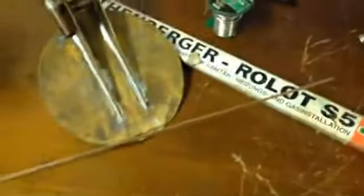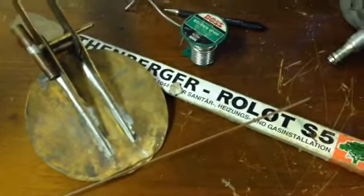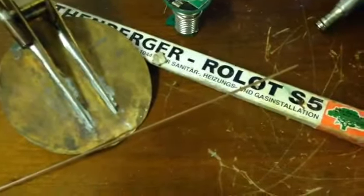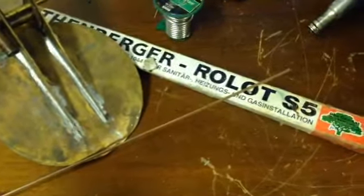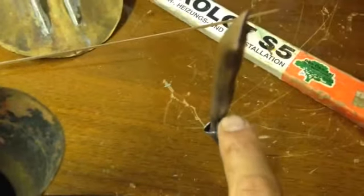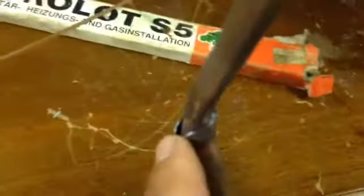A perfect example: if you're soldering a piece of copper pipe to another piece of copper pipe, the bits of copper have almost got to touch the fitting. If not, the solder won't bridge the gap. Very different with this stuff. Here's an example — what I've done here just to show you, I've stuffed one piece of copper pipe baggily into another and I've started brazing it. You can see how it's brazed lovely around here and I've still got a hole here.